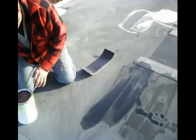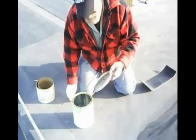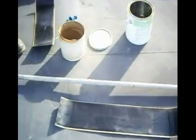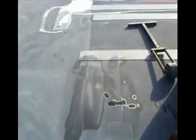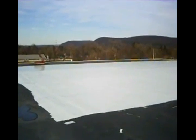They say you don't need the primer, but if you use this primer — which is basically like a contact cement, only quite a bit thinner — the tape is an adhesive-backed patching tape, six inch. If you use that primer and put this down, you'll have to rip the roof off in order to tear that patch back off. The way we look at it is, if you're going to put something on the roof that's going to last fifteen to twenty years, you don't want whatever is underneath coming back up.